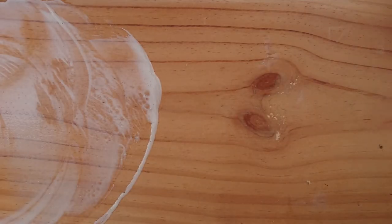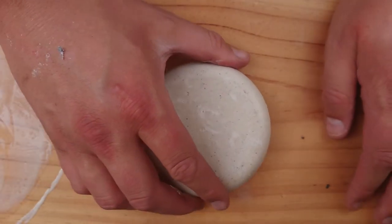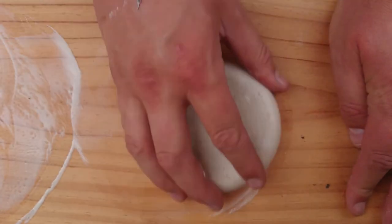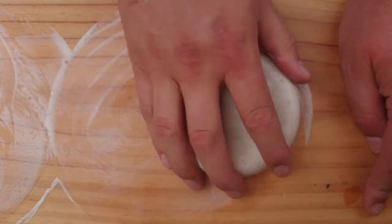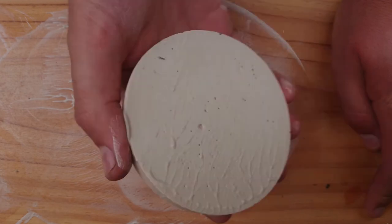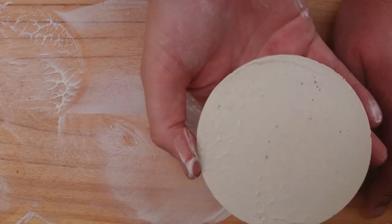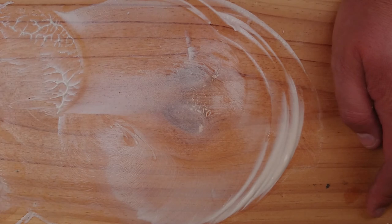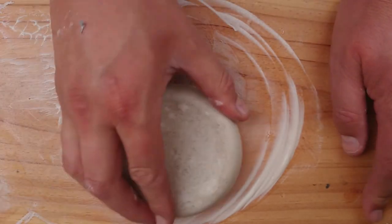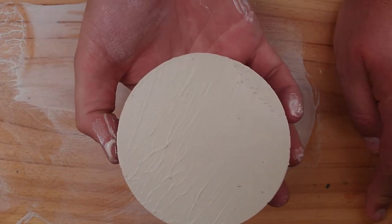I did a bit of thinking just before I brought these in to cool off overnight. They're quite hot from sitting on hot concrete, plus the reaction itself. I wanted to smooth off all the bubbles from the surface. I found a nice flat piece of pine and thought while the plaster is still wet and soft, I can use it as a polishing compound - rubbing it on the flat pine to grind down all the inclusions and bubbles. The wetter mix has some big bubbles near the surface, but the slightly thicker mix is creating quite a nice even surface.